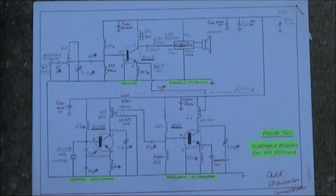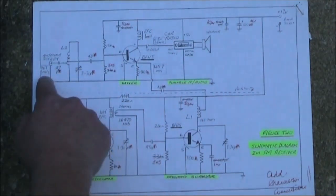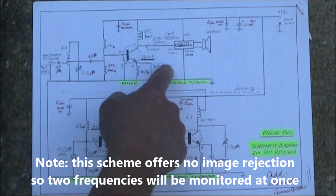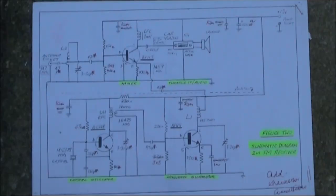One thing you could do with this arrangement, though I haven't actually tried it, is to incorporate this in a 2-metre FM transceiver for repeater use only. The crystal oscillator and the frequency quadrupler would produce a signal on the repeater's input frequency. Those stages would still be on during receive. A low-level signal on the repeater's input would be injected into the mixer, and if the car radio is tuned to 600 kHz, you'll be able to hear the output of the repeater. You just have to tune it slightly off 600 and you'll be able to slope-detect it. For 6 metres, where we use a 1 MHz repeater offset, the same principle would also apply — you'd tune the car radio to 1 MHz.